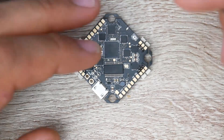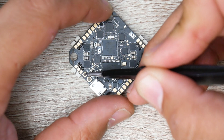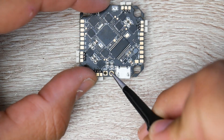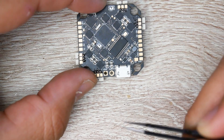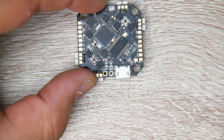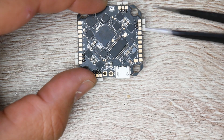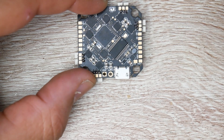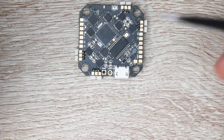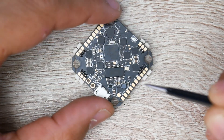The next thing is to apply power using your XT30 or whatever connector you're using — there are two pads for ground (black wire) and lipo positive. I highly recommend you add a small low ESR capacitor because the filtration is very minimal. You can buy XT30s with capacitors pre-made; I'll have them linked below. I get a couple every once in a while to save time and they're executed very well.